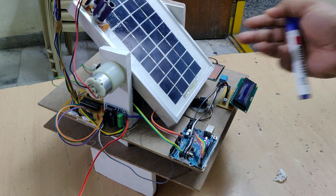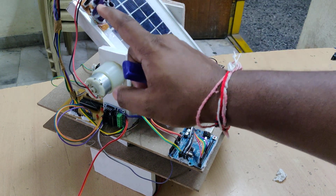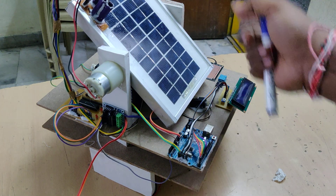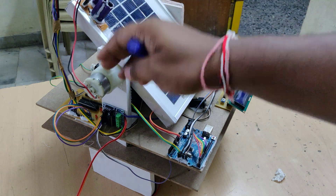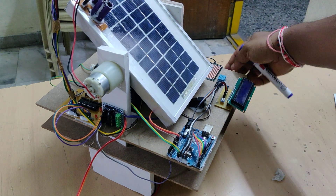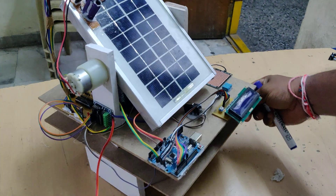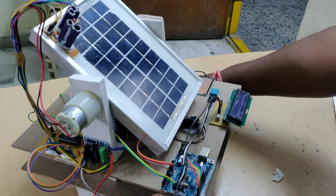These are the main inputs in our project to track the sun position, using two DC motors. One DC motor handles east-to-west rotation — and west-to-east when sunset is done. Another DC motor is placed under the tilt mechanism, which is used to control the south deviation axis.